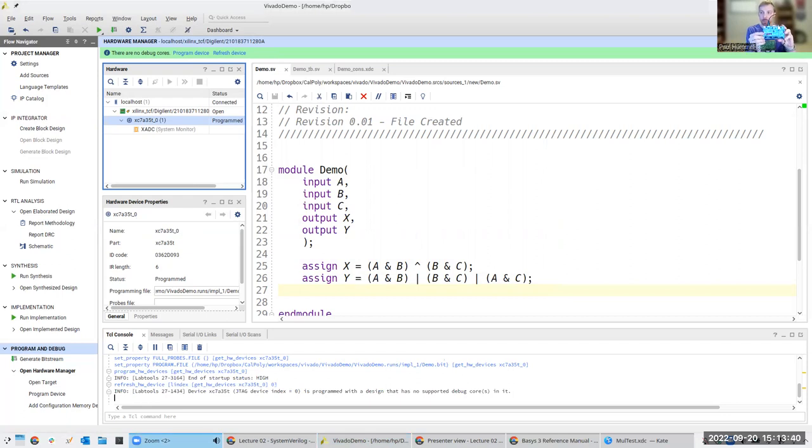Essentially, this becomes green. And as we flip up some switches, right, notice we get some LEDs that show up. And so right, we could essentially kind of go through all of our input combinations, right, and see that this actually should match again our truth table, right? So anyway, we could go through this process and this should essentially exactly match the 8 possibilities that were in our sim. But now we have our design actually running on our FPGA connected to switches and LEDs, right? And so there you go.